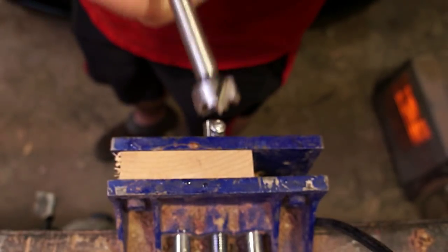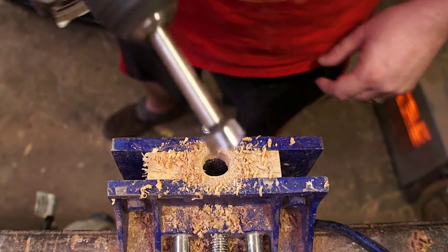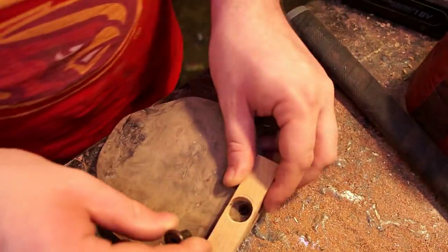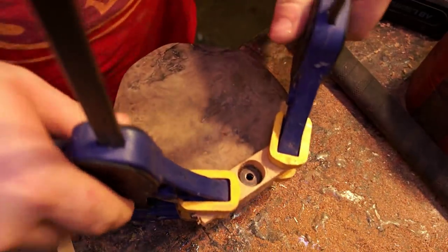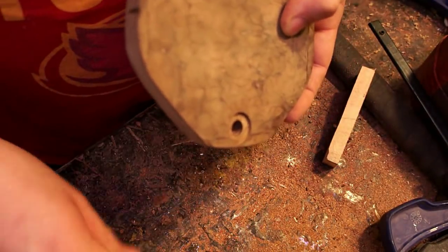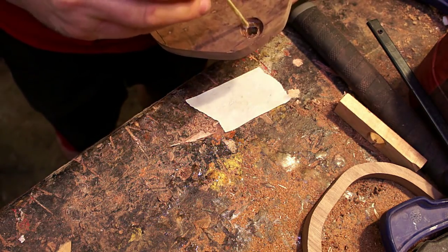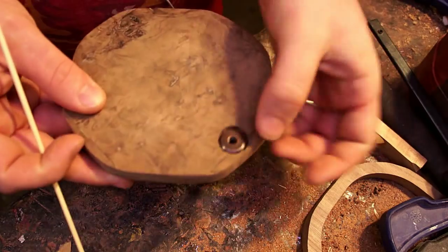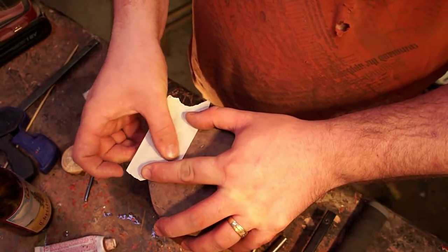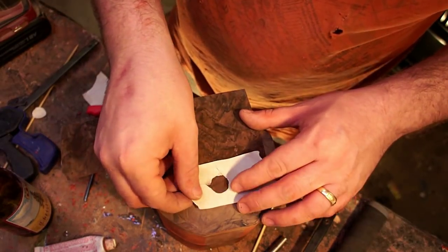I learned a cool trick from the Duresta channel — basically you get a piece of wood, use a Forstner bit, and drill a hole in it. What this does is give you a different reference point: normally the Forstner bit has that little brad on the point that you stick exactly where you want the center to be. But if you try and do that in a hole that's already there, the bit is going to wander around and tear up everything. So I locate that hole exactly where I want it, take out the threaded insert, and then the side of that already-drilled hole in the guide piece references off the side of the hole in the workpiece, getting it to go exactly where I want. Test fitting it — it looks flush. Now I'm mixing up two-part epoxy, putting it in that cavity I just drilled, and then putting the insert in. After I put the trim piece around the edge, I didn't want you to be able to see the hardware, so I put a piece of masking tape over it, cut out the section where the hole is, lay it back on the veneer, mix up a little more two-part epoxy, and put the veneer over the head of that sunken screw.